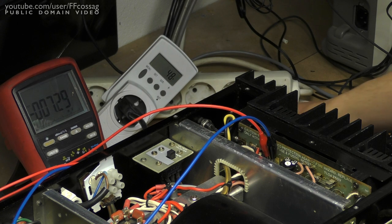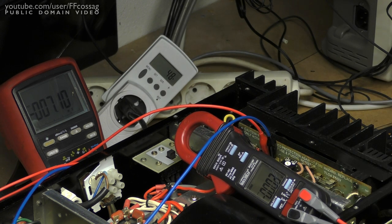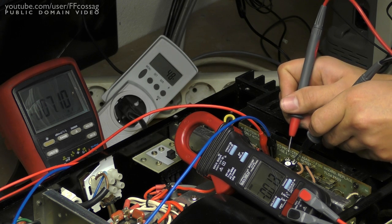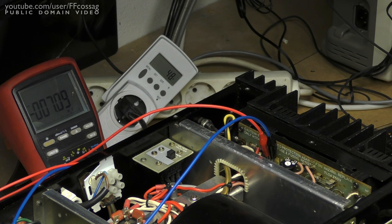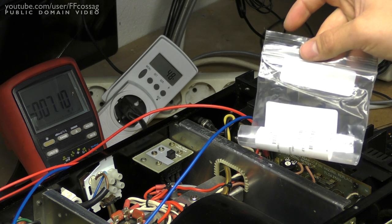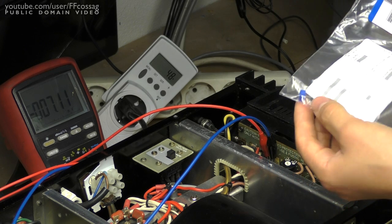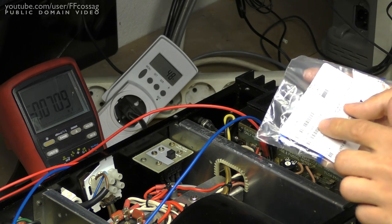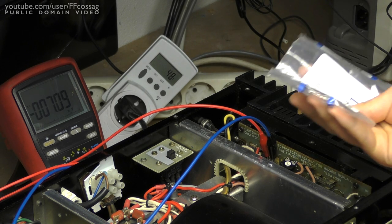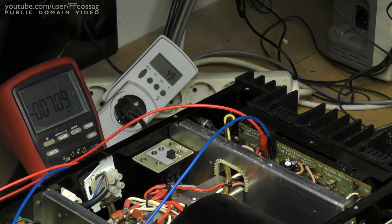Since the original potentiometer is such a large unit, I was afraid there would be a rather high voltage and high power associated with it. But if we just measure the voltage across the pot, it's just one volt. It's a 1K pot, so you can pretty much use any potentiometer without running into issues. I happen to have a couple of brand new ones I purchased for my SX950 Pioneer restoration — they're the wrong capsule and a bit tricky to mount, but they're good enough. They're rather expensive Bourns pots which performed excellently in the Pioneer. So I'm going to dismount this channel and put a new pot in there, just so that I don't sell a faulty unit.